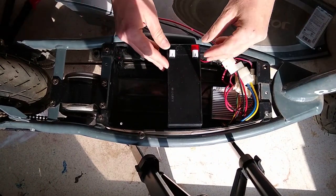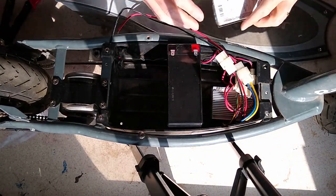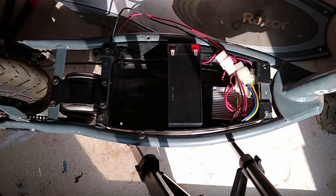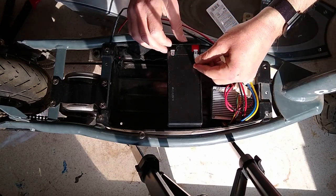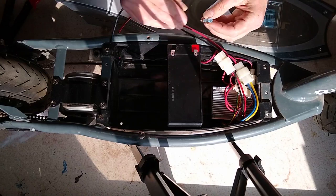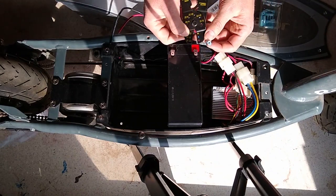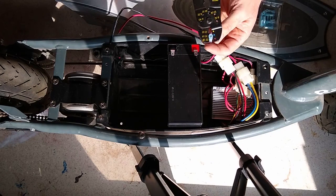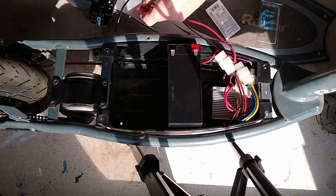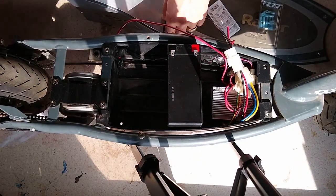Basically what we're going to do is use these connectors to connect to the end of the batteries here. You can see it's just going to slide right on. This end would use this crimping tool up here where it says 14 to 16 — you crush it on the wire and put that in to connect this to the wire. Let me go through that whole process once.